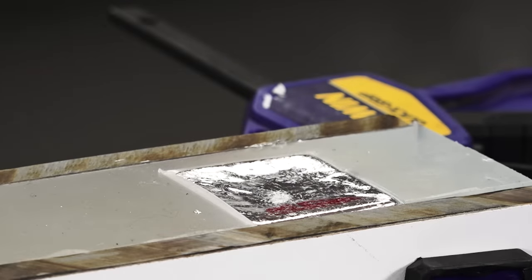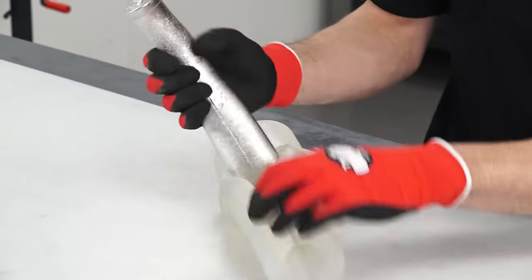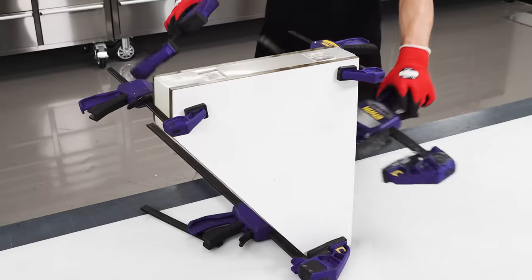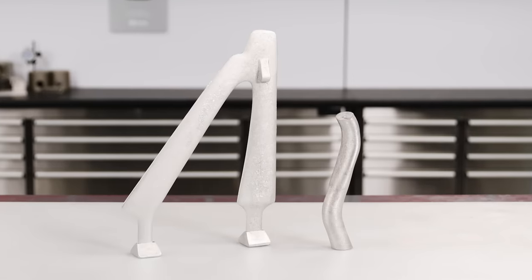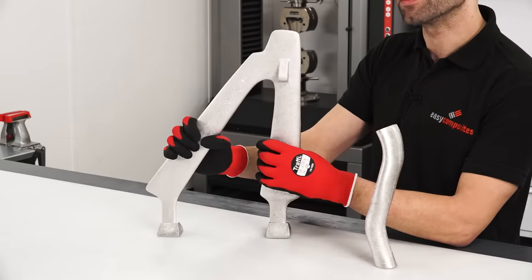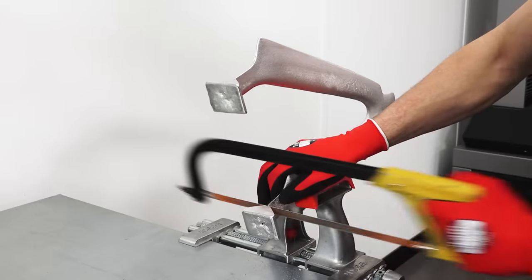You can see here a very small amount of shrinkage occurring as the metal solidifies. Once the alloy mandrels have cooled, they can be removed from the moulds. The AS40 provides effortless removal and doesn't need any release agent. We now have our finished cast mandrels — I am really pleased with the accuracy and the finish that we've achieved on these. To prepare the wishbone part for the laminating process, I'm just going to trim off some of the unwanted casting features.